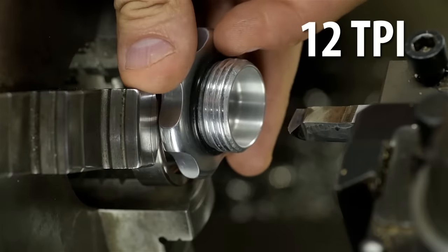Machining titanium stinks. It stinks the whole time you're machining it, but it's awesome once you're finished. Everything gets hot, your tools wear out, the chips won't break — but just look at those things. I should also mention titanium swarf is a fire hazard — fine titanium shavings. I did have a few instances of my chips sparking bright white at the cutting edge, kind of like magnesium, but fortunately no fire. Just because I didn't burst into flames doesn't mean you won't, so be careful. Aaron only really wanted one of these things, but he sent me two pieces of stock. I suppose he thought it wise in case I screwed up the first eight parts. Frankly, I was offended at the suggestion — then again, I did wait until all these parts were finished before telling you that.